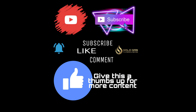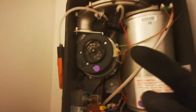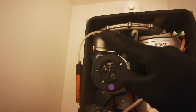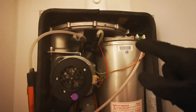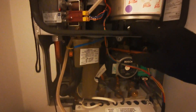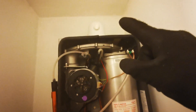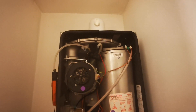Here's a quick flow chart — any of those red arrows, if there's a blockage anywhere there, you're going to have a more positive reading, so it just gives you a bit of insight. It starts from the fan, then to the burner arm, into the burner and the main heat exchanger. You've got the baffles, then the sump, and it goes up into the flue duct, up into the flue turret, and then out to your flue.